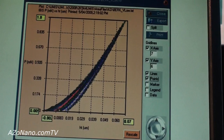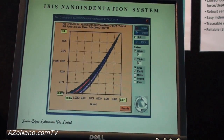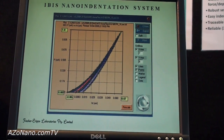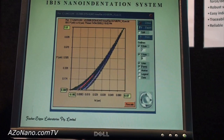This is a series of load displacement curves, and in this case the maximum depth of penetration is about 70 nanometers, starting from about 5 nanometers. So for this particular test, we're able to calculate the elastic modulus and the hardness at depths of penetration from about 5 to 70 nanometers.